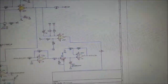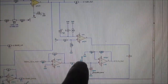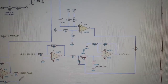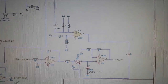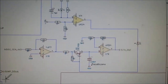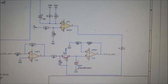What we have here is a circuit borrowed from the Minimoog schematics for the sample and hold. There's a little FET — a field effect transistor, not a bipolar transistor — with a source, drain, and gate. We feed that FET with a noise generator, come out of the original noise generator, invert the signal into another op-amp, and come into the drain side. The holding capacitor is polyethylene — the small rectangular box style — at 0.1 microfarads, which is 100 nanofarads.